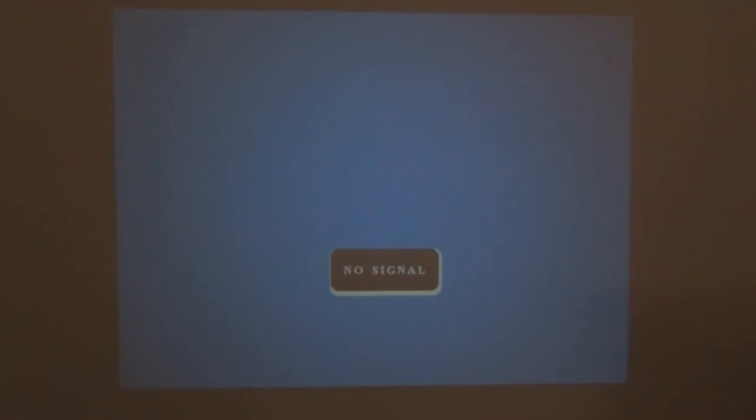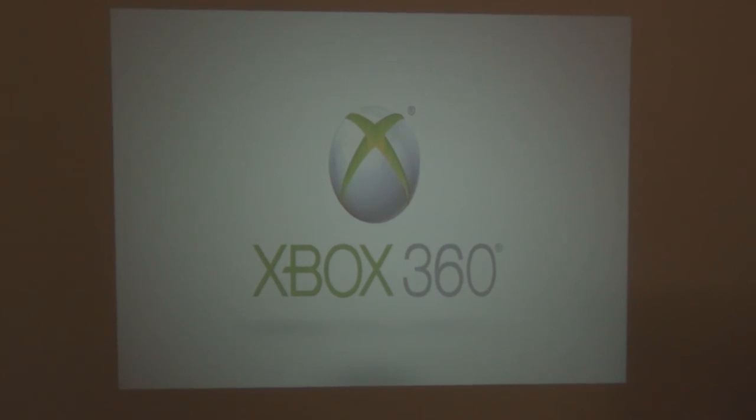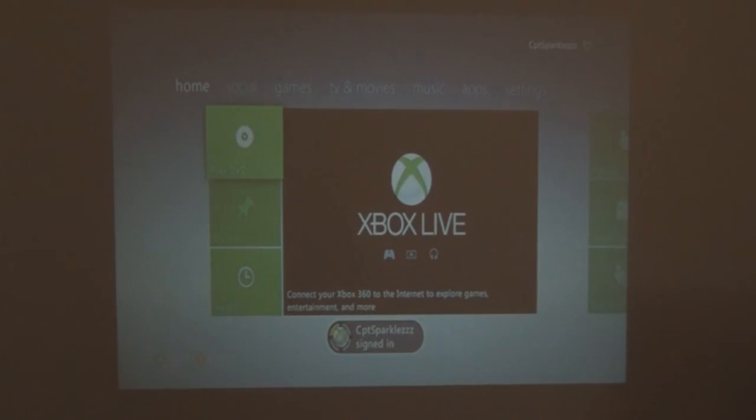Now I did want to go over one more thing, and that is the 5-volt power method. So we'll go ahead and plug that up and I'll show you guys just how bright the screen is. So we've got the 5-volt power plugged in — this is a 2-amp port — and as you can see it's a lot darker than the 4 amps we receive from the main power supply. So essentially this is half the brightness it can give off. I wouldn't say it's impossible, but it's definitely a lot harder. The thing I think is super cool is that you can essentially power this almost like a TV from a micro-USB cable — just at a very dark brightness setting. I think that's pretty incredible.